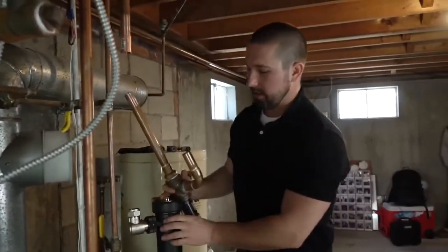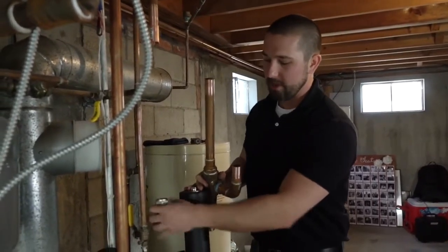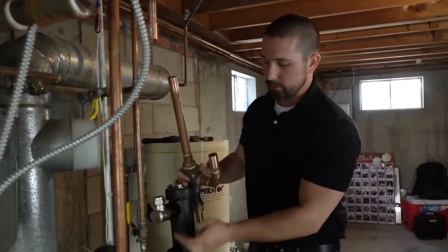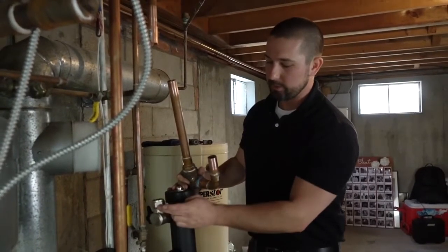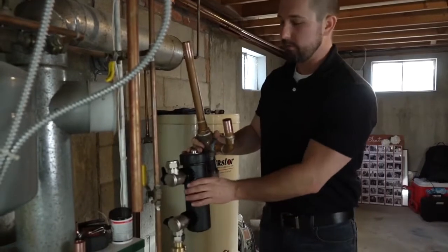On this filter itself, we have two fittings that have a full 360-degree swivel, so it doesn't have to be a vertical installation. Also, supply and return are interchangeable. In this case, we're using the top as the supply and the bottom as the return, but we can flip-flop this — it doesn't matter for the filter body.